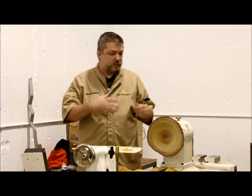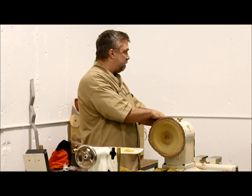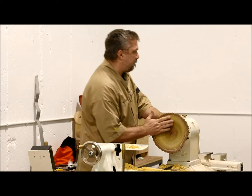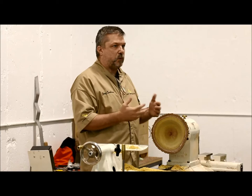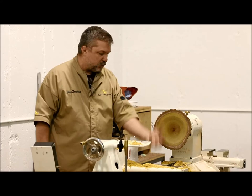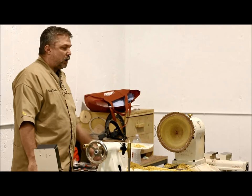Can you just go over the oil process? So you're on the lathe and you mop it on the back first? I'm going to mop it on the back before I turn it. Now that I've turned it, I put another coat on the back and a coat on the front. I will let it sit — I don't want to bother wiping it, I just let it go in. Wiping it removes what I'm trying to do. And at that point when I take this off, I will set it down and put one more coat on the top.